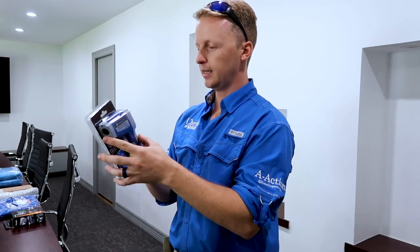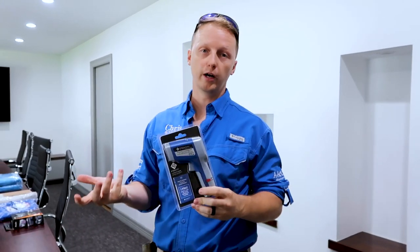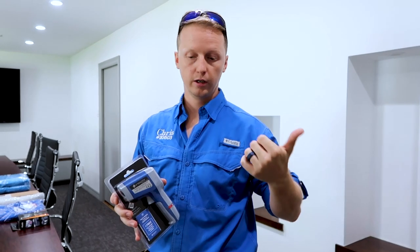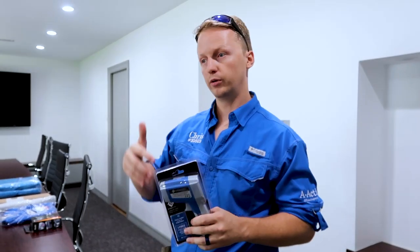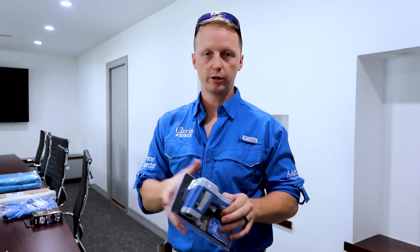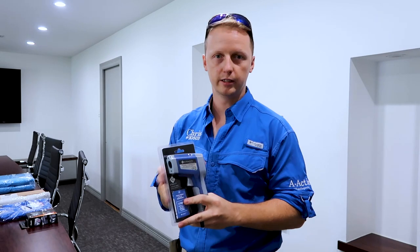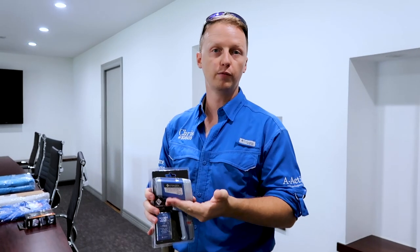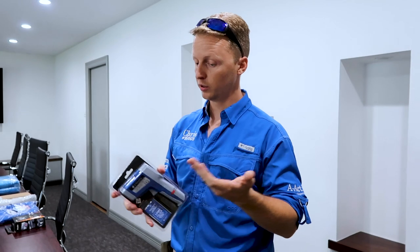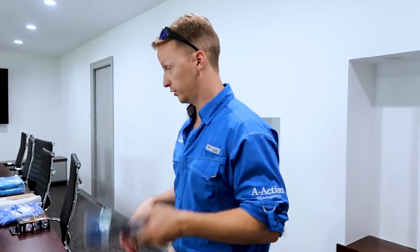The next item is the infrared thermometer. This is what you're going to use most of the time to get temperatures off your AC units. You'll hit the air return, though the air return almost reads the same temperature as anywhere in the room — so you can point it almost anywhere. Remember it's reading surface area, so you have to understand how you're reading these temperatures. It's really good to prove that the heat and AC are working on the day of the inspection. Every inspector carries one of these.